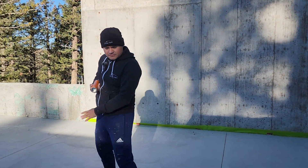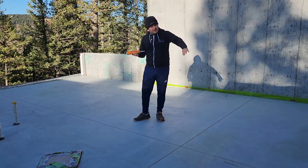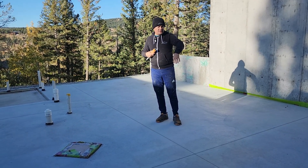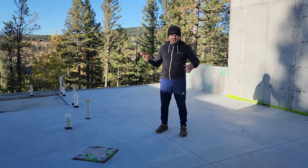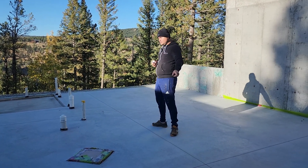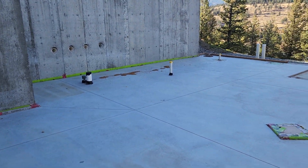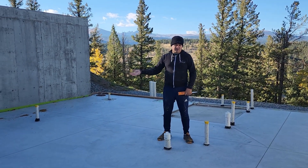You might be able to see some lines in the concrete — those are the control joints. The biggest advantage of Master Seal NP1 is that it doesn't actually cure, so when applied it just expands and contracts with the joints. The purpose is to control what's inside those control joints — otherwise it'll get full of dirt and water, and ice may come in, expand, contract, and crack it. For control joints, the rule is to apply squares no bigger than 10 to 12 feet so you can better define how the concrete is going to crack.